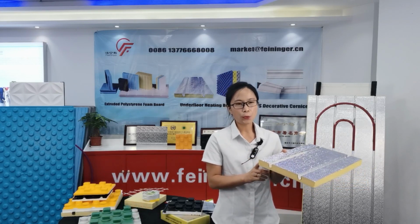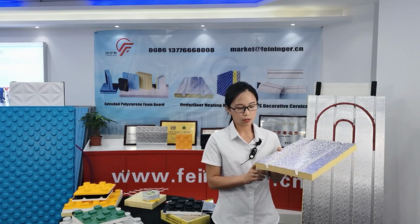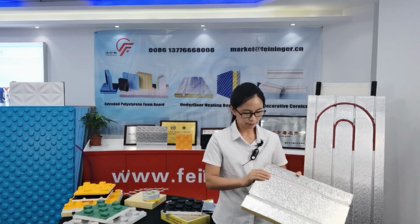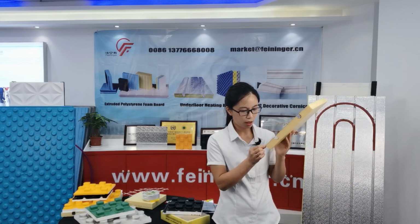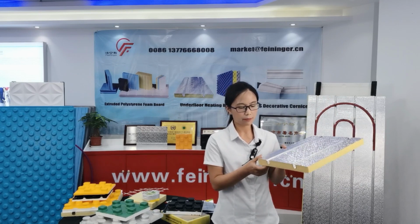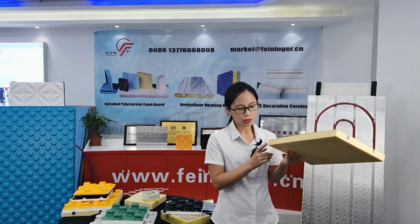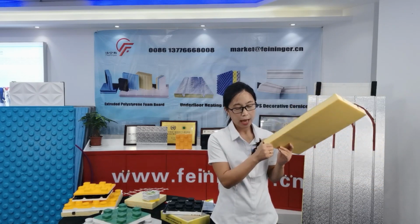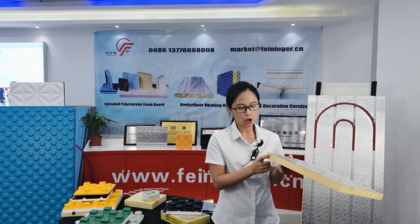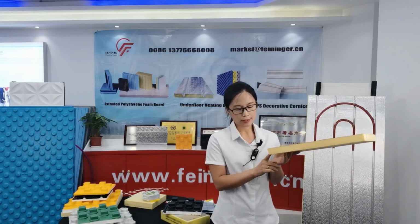For the XPS, we can produce 150 kPa to 1000 kPa. So, customers can have a lot of choice according to your requirement. For the XPS with aluminum foil, the thickness is 0.22 millimeter. For this board, its features are good insulation and high compressive strength. We can make at least 250 kPa. Also, we can make 1000 kPa. So this board has high compressive strength.